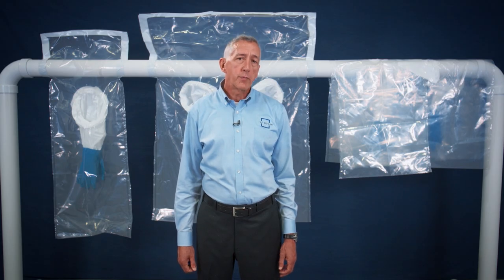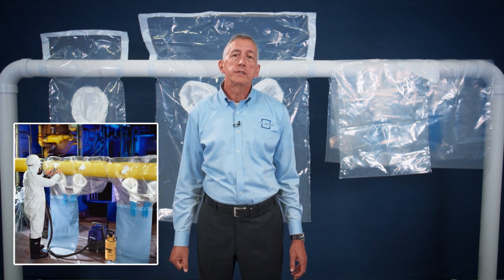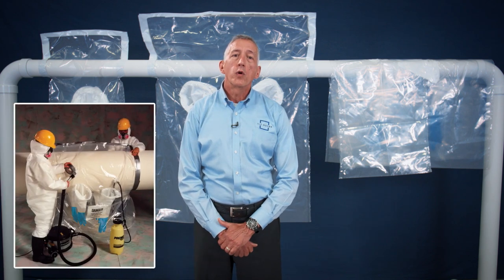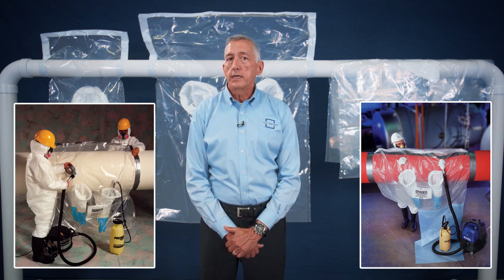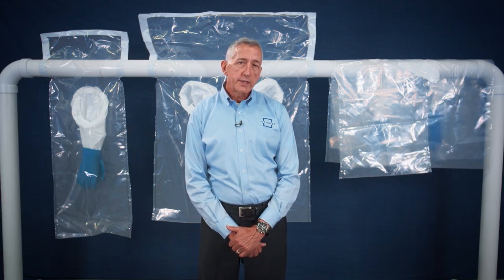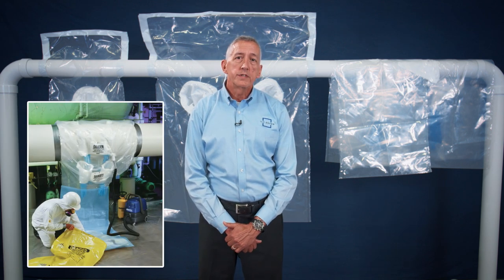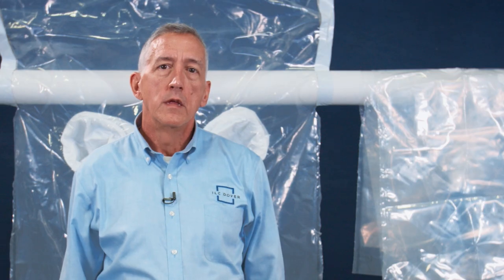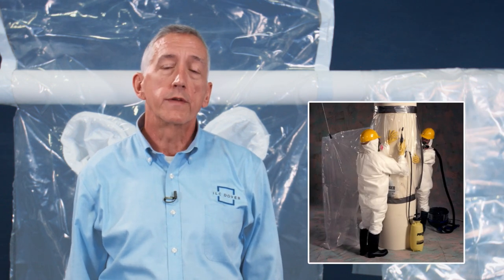For larger diameter pipes, we offer both a 60 by 72 bag and a QT-14 for pipes up to 14 inches in diameter. For pipes up to 18 inches in diameter, we offer the 66 by 84 and the QT-18. On the 66-84 and QT-18, we install another set of glove sleeves so that all areas of the pipe can be accessed. For pipe up to 30 inches in diameter, we offer the 72 by 120 and the QT-30, with two sets of glove sleeves on the 72-120 and three sets on the QT-30. The largest vertical glove bag we make is the V-24, designed to accommodate pipe up to 24 inches in diameter.